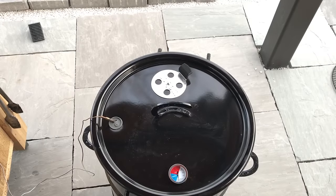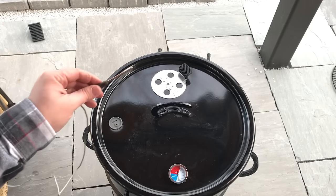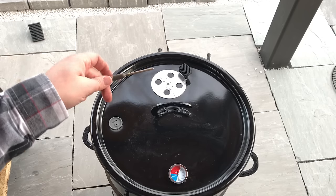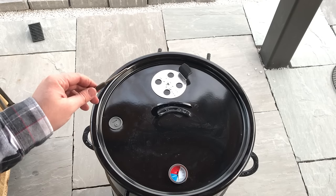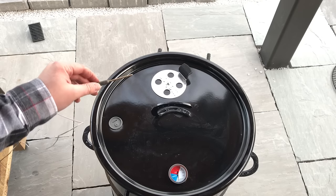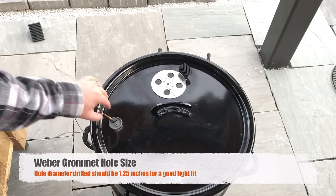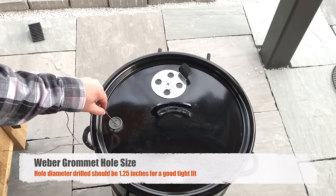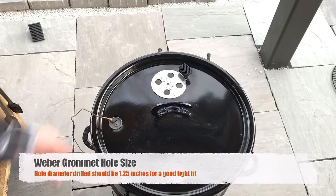We finally got our grommet set in place. That was a little bit more of a chore, but this is going to be handy. Just be careful when you're drilling that hole. There's a fine line between too small and too big for that grommet. So that goes in there just fine. I find that if I try to put it through that hole, there's just enough resistance that it wants to pop the grommet out. So that's fine. We'll use that little slot there, and that'll work out all right, just fine for me.